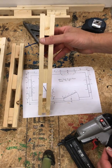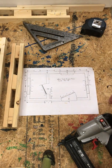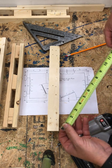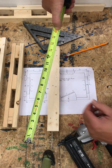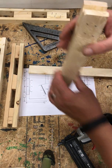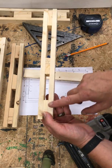On this floor plan, count one, two, three, four corners — you need to make four corners. As a reminder for common stud length: on a two-inch scale model, if the real walls are eight feet tall, then two inches equals one foot, making the total model wall height 16 inches. Deduct an inch and a half for the thickness of the bottom plate and two top plates, leaving 14 and a half inches — that's your common stud length.